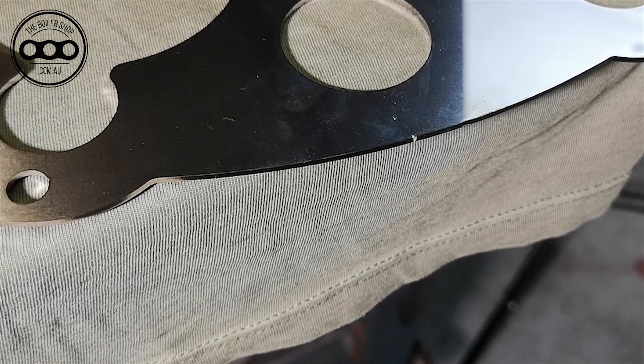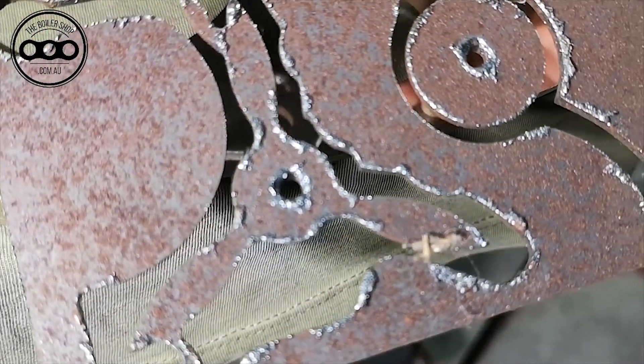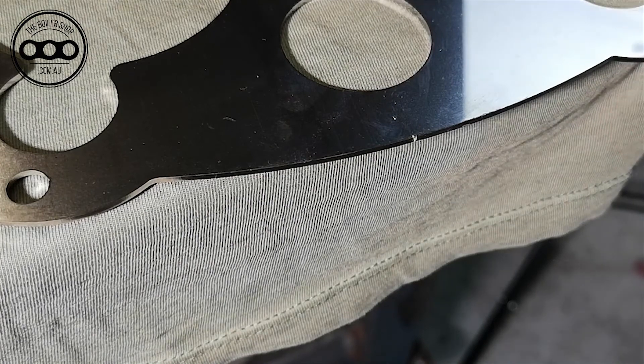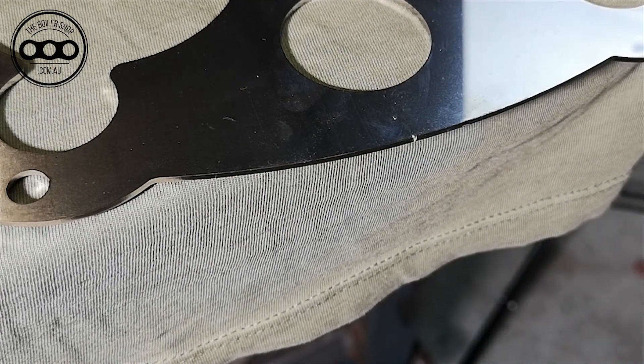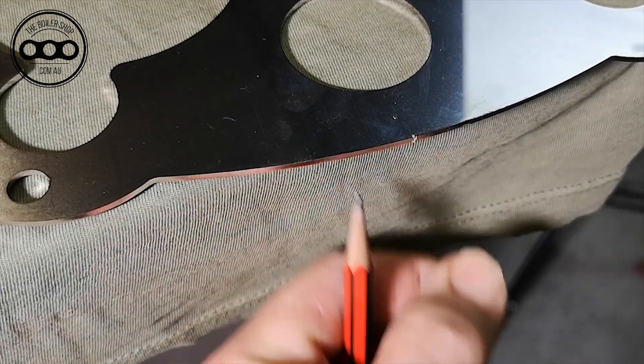In comparison to plasma cutting, look at the difference. Here's some plasma cutting — look at the dross and slag that's left behind. It needs a good clean up. The accuracy is so much more superior in laser cutting, so you have minimal to clean up, but just be aware of this lead-in point.